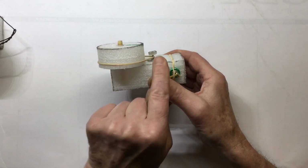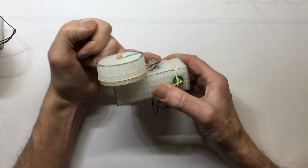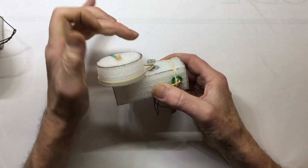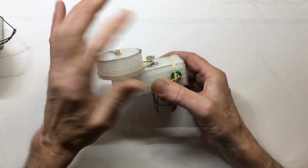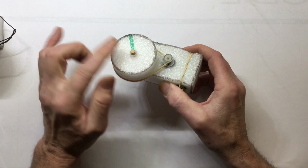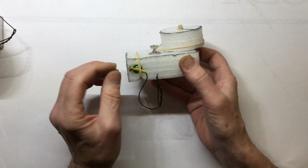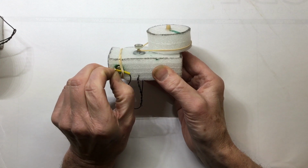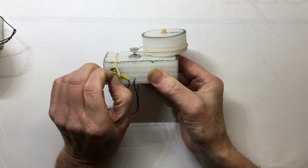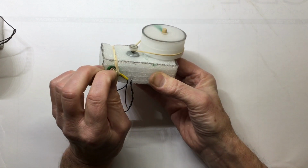And in this particular case, we've got the elastic band being held on by a tiny little cylinder of glue stick. So I've cut that off as a little cylinder, pierced a hole in the centre, and all it does is provide an end cap which stops the elastic from jumping off. And then we've got a thicker wheel. There's a wooden axle. There's our battery as before. The wires can be tidied up. This one doesn't have a modified switch, so simply move the paper fastener into position. And there's the rather noisy wheel spinning around.